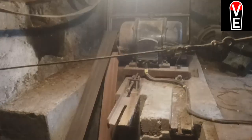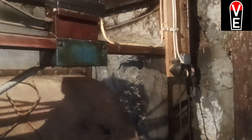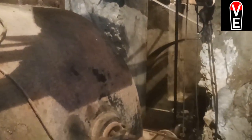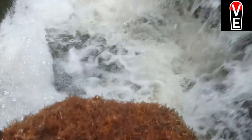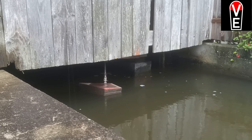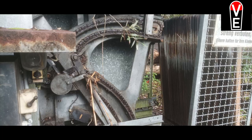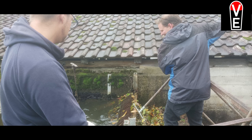The most challenging thing about hydropower is the water flow. Because you need 50 hertz in the grid, there is an intelligent regulation system with flaps. Here you see the water intake, and there is a float regulating a flap to always maintain the same RPM. Another challenge is debris in the river, which can be sorted out automatically or manually.